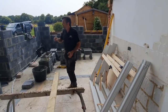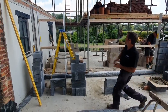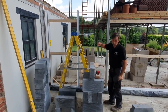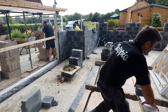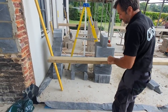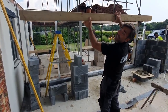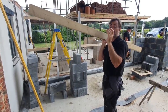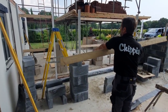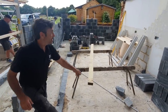What I'm going to do on these bigger cavity closures — the brickies have come up with the reveal and are plumbing it nice and true. I've got three more legs here. I've got a section of four-by-two, and I held it across, marked off the positions of all the legs, and I'm going to knock out notches so it drops over the top in the middle of the cavity to keep them all parallel.